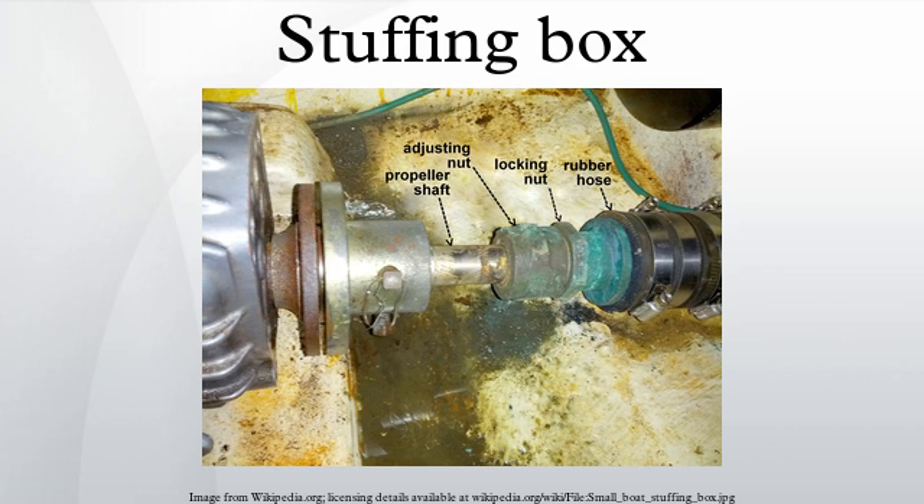The box is a cylindrical assembly, typically of bronze, comprising a sleeve threaded on one end to accept adjusting and locking nuts. A special-purpose heavy-duty rubber hose attaches the stuffing box to a stern tube, also called a shaft log, that projects inward from the hull. Marine duty hose clamps secure the hose to the stern tube and stuffing box. A sound stuffing box installation is critical to safety because failure can admit a catastrophic volume of water into the boat.